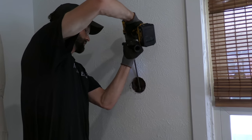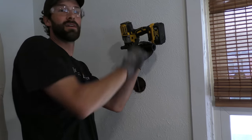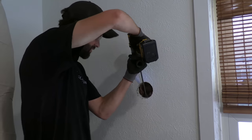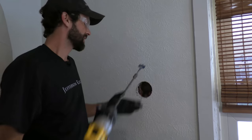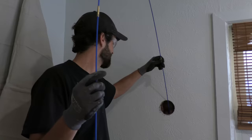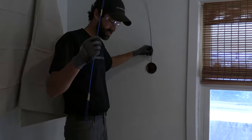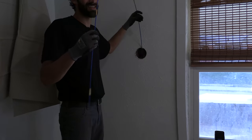Brutal, brutal — that's where you keep a handle on your drill so it doesn't smack the wall or your nose. There it is! See, a bit of that size — that's like a 1-5/8 — is pretty aggressive, so you're going to get a lot of torque. Put a hook on the end of your fish stick — that might help it drive through the insulation. I don't expect having any great difficulty. Famous last words.